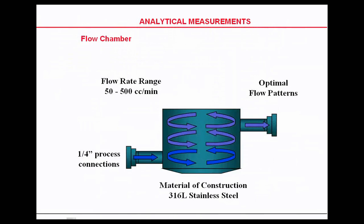The flow rate on the Honeywell system ought to be somewhere between 50 and 500 cc's per minute. It's good to note that Honeywell has this not only for pH but also for ORP applications. The flow rate should be between 50 and 500, with about 250 cc's being an optimal measurement. We swirl the sample so that we actually contaminate the sample with the salts because it is low ionic.